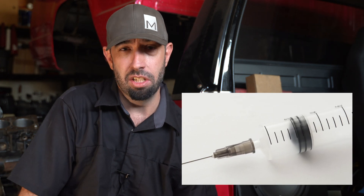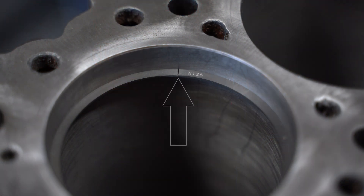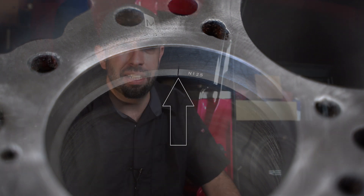To bring you up to speed, the piston ring's purpose is to create a tight seal against the cylinder walls, the way a rubber plunger does inside a syringe. But since rubber would burn up in an engine cylinder, metal rings are used instead. The rings I ordered were too small, which makes the gaps at the end of the ring too large. End gap is really important to get right because an improper gap could potentially cause all kinds of issues. A gap that's too large could allow air to escape past the rings, lowering cylinder compression, and therefore decrease power.